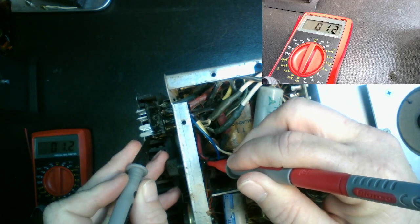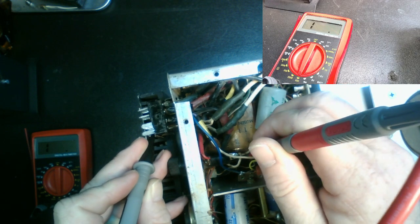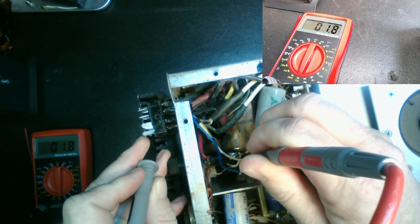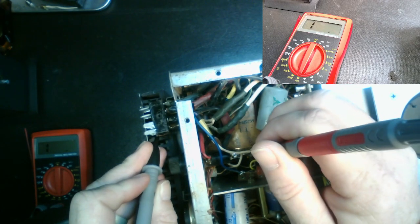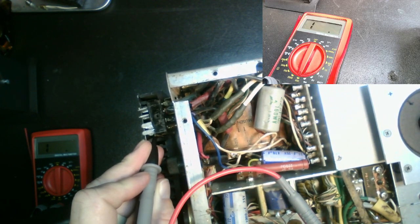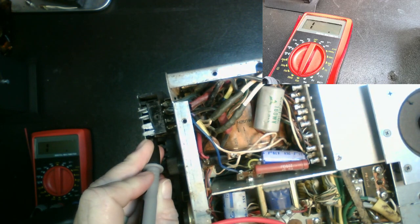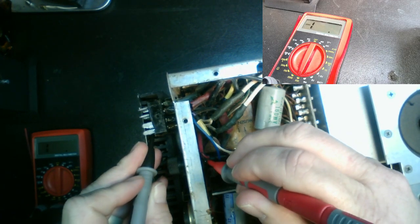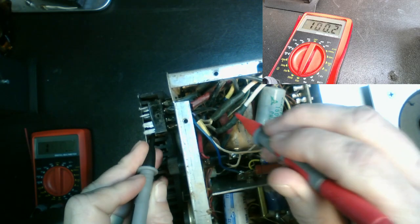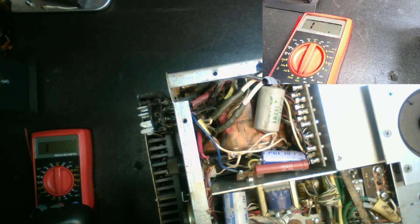If I just go to the fuse holder — I've got continuity. So our hot line is connected straight to the fuse holder, and if I go to the zero volt tap I still have continuity. Let's go to three — three should have continuity to those points. As you can see on the meter, it doesn't, unless I turn the switch on. Three is the one that should be constantly connected to those, and two should not have continuity unless the switch is on. So these two wires are just flip-flopped between two and three on the connector — fixing that is going to get the power switch working again.